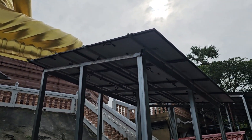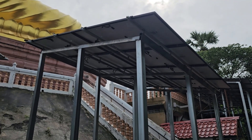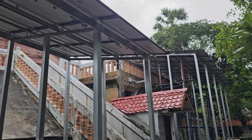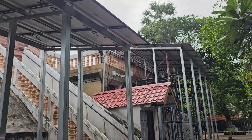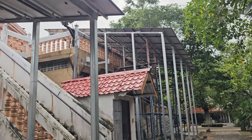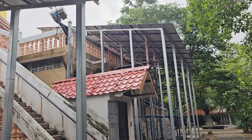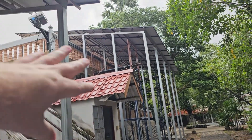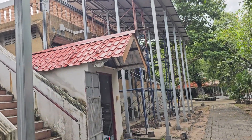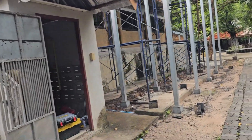You can see, already before 9am, the sun is fine coming over the treetop and hitting all the panels. That's an interesting thing in Thailand — trees are actually less of a factor than you might think. If you have very big trees to the south close to the panels, that will not work. But in this case that's obviously to the east, and if you have a little bit of trees to the east, it doesn't really matter, because the energy you lose in the morning is so little.